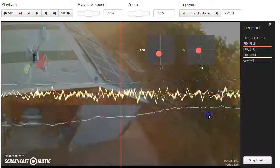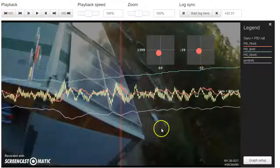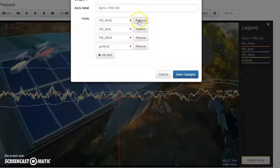And that bounce back can be caused by any number of things. If you have an oscillation at the end of a move, it could be excess P gain. It could be too much or too low D. It's kind of like a three bears thing, right? You could have too much, too little, and the symptoms can be hard to read. It's only when you're just right that you actually hit the mark. So in this case, it feels like the thing to do is to raise the P gain, as you suggested. Let's take a look at pitch.